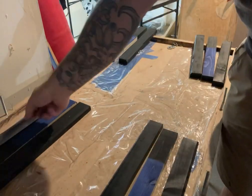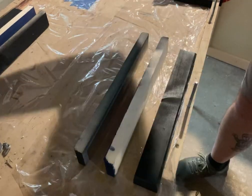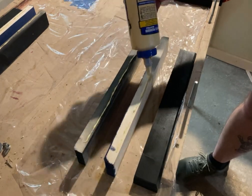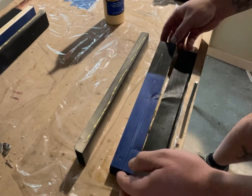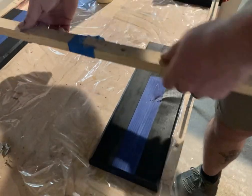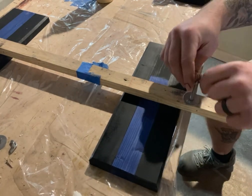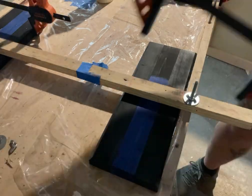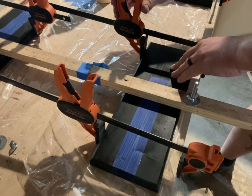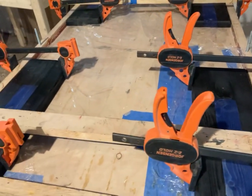Now it's time for glue-up. I'm using the same flag jig I've used in previous videos — I did make a video on how to make the flag jig, it's on my channel. Using the same method as when you're gluing up a flag, I used Titebond 2 wood glue and put it on the edges of the stripes. A little note: I put the glue on the bottom half of the stripe to help prevent squeeze-out from coming up onto the finished wood. The nice thing about the flag jig is I can do four bottle cap openers at a time, and I have two flag jigs, so I can do eight at a time — this really helps speed up the batching process. I'm using the Pony Jorgensen clamps for the glue-up. I'm not sponsored by them, but I do use their clamps exclusively because of how well they work.